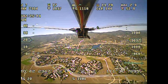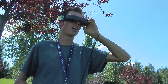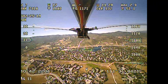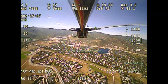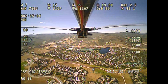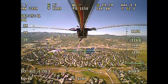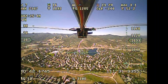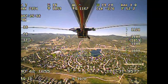Right now I have a Genesun GV10 — a 10-amp boost controller that boosts the solar panel voltage up to the voltage of a four-cell battery. That could be a problem because I'm using a five-cell on this plane. These panels are putting out about 23.5 volts, so I don't actually need that boost converter. I need to figure out if this charge controller will work, or if I need a step-down controller that takes the 23 volts from the panels and steps it down to around 20 volts for a five-cell.